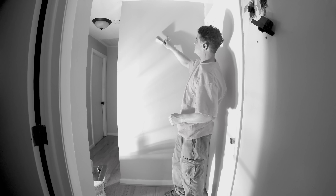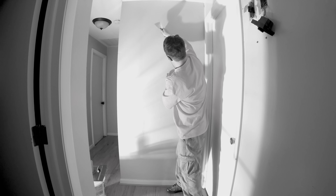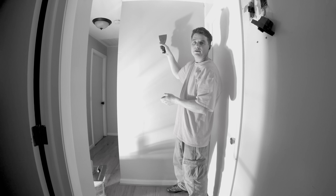There's a screw on the wall. I'm going to take the edge of my blade and grind that in so that it's concave, so when we mud over it, it'll fill in the impression.